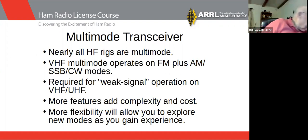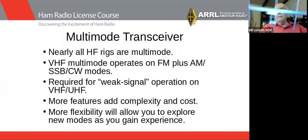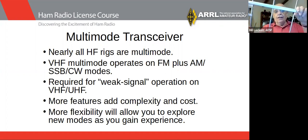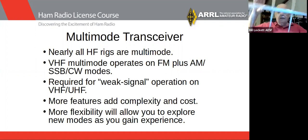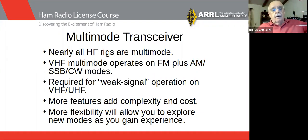The weak signal antennas like this one. As you can see, it has lots of elements on it. As you learned, these are the directors. This is the driven element, and this is the reflecting element. And so this is the longest element. This is the next longest, and this one is shorter than this. And all these directors are the same length as this one. They're all the same. And you may ask, what is this right here? This is a gamma match, a method of making this antenna 50 ohms so that it can connect to a 50 ohm coax, and you can use it.